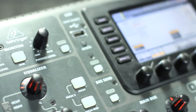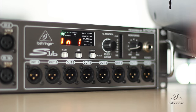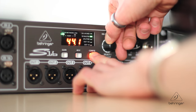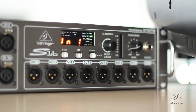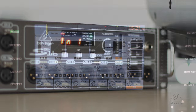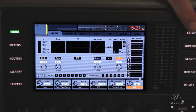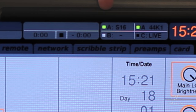Just for our own understanding, let's see what happens when we try to make both devices the master. Back on the S16, we'll hold down Config and use the H8 control wheel to select a sample rate setting. Let's go with 44.1kHz, same as our X32. Red panic LED — no sync. Same over on the X32. But what we can do in this instance is set the X32 as the slave. Let's select AES50 port A — this is the port we are using. Green LED, success.